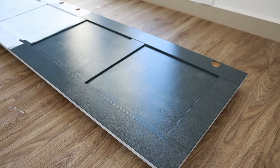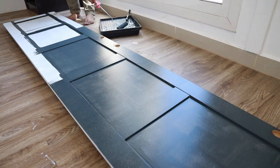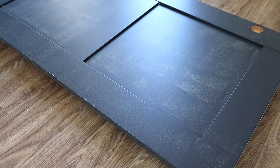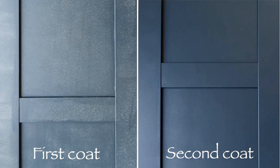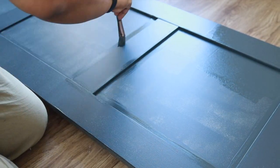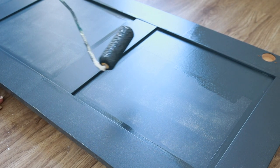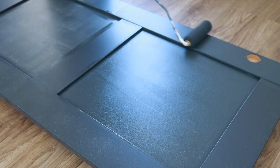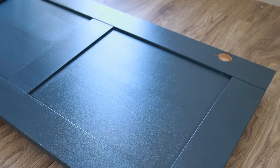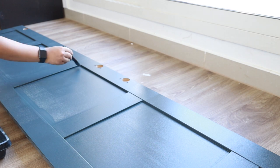Don't try to roll over the same area again and again to get that perfect look at once, even though it's so tempting to do so. After the first coat, it's going to look great with the second coat. Although the paint may feel dry to touch soon after applying the first coat, wait until the paint has had enough time to cure fully before applying the second coat — I started my second coat only after 6 hours. An eggshell finish is a light shiny finish which I highly recommend for furniture, as it helps reflect light and is easy to wipe when cleaning.